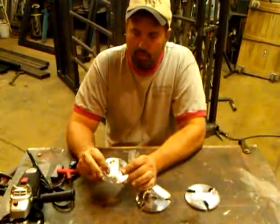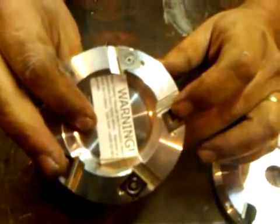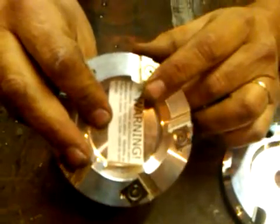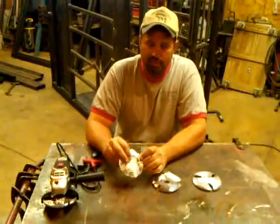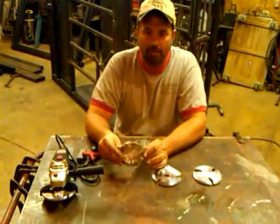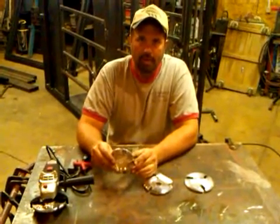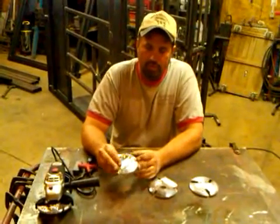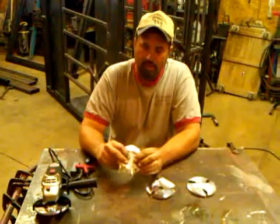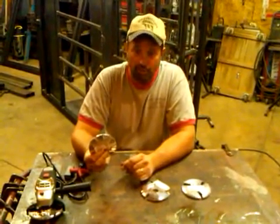Now, if you're going to use a rotor clip wheel, which they have a pretty good product, you're going to spend about $9 a blade. And $9 a blade, they got you 2 surfaces. This has got you 4 surfaces. The nice thing about these blades, you just throw them away when you're done. No sense of sending them back in to resharpen them and messing around. If you have a rotor clip blade, you have to send them back in and resharpen them, $2, $3 a blade. And they're just not as sharp as when you first got them. So you want to have good equipment, sharp equipment. Put new blades in there. For an average farmer, you probably won't even change the blades for maybe a year or 2.